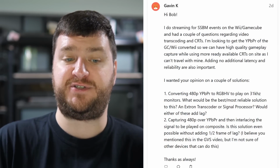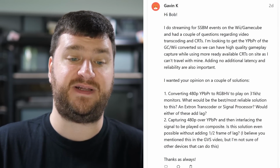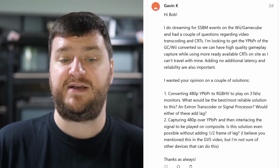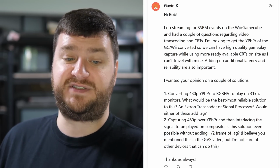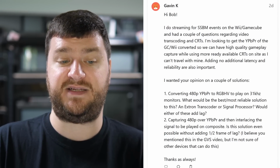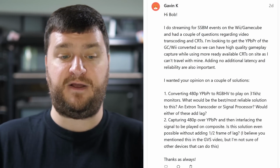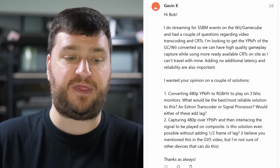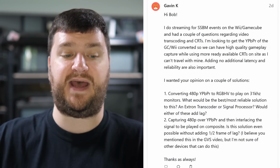Gavin K does streaming for Super Smash Bros. events on the Wii and GameCube, and had a couple of questions regarding video transcoding and CRTs. They're looking to get the component video output of the GameCube and Wii converted so they could have high quality gameplay capture while using more readily available VGA monitor CRTs on site, as they can't travel with their CRTs. Adding no additional latency and reliability are the important points here, so they wanted my thoughts on a couple of solutions. First, convert 480p to RGBHV VGA to play on 31 kHz monitors. What would be the most reliable solution to this, and would it add any lag?